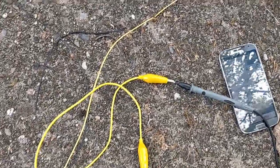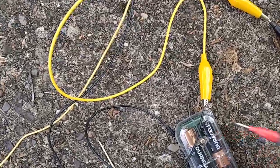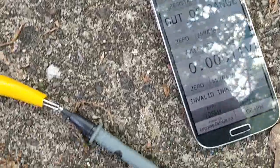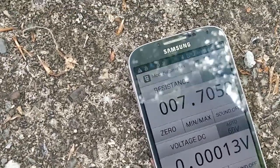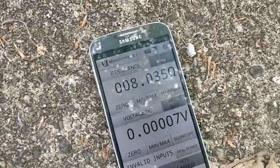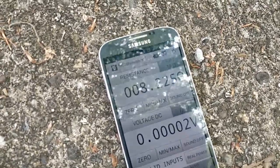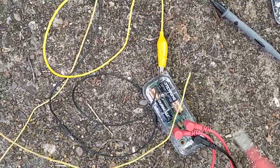We've made it all the way around the loop, all the way around the backyard. Let's try it out and see what we get. Getting up to the trusty multimeter — big long loop around the yard — we got 8 ohms! We have continuity. That should last a while, barring any more breaks. But that's fences for you, they always need repairing.